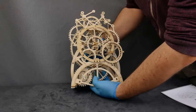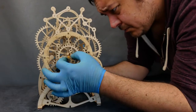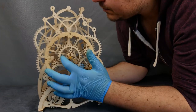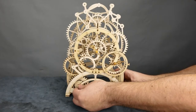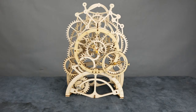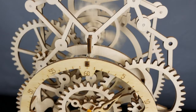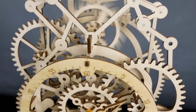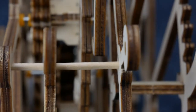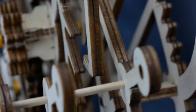As if things were going to be that easy. I must have been particularly terrible at this, as every time I tried to get a wheel in, another would pop out. But finally I managed to get them all in. Double check that everything is aligned and running freely, then give the clock a bit of a wind. Wind slowly and stop as soon as the wheels start moving. Check that everything is running true, then add in the pendulum. Here I'd mucked up the spacers, so this had to come out and be reassembled correctly. And there we have it — one finished clock. Although we're not finished, we've got to get her ticking correctly.